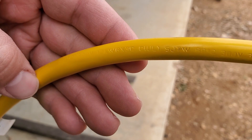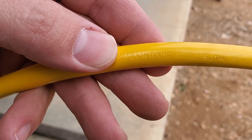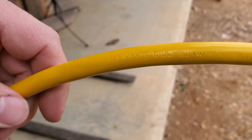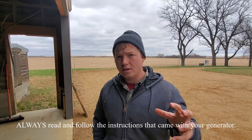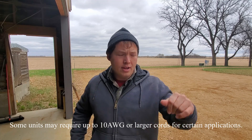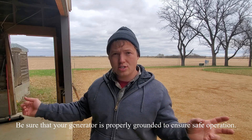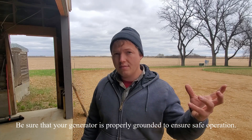If you look closely at the printing on the side of your cord, you'll be able to see — this one right here is a 12 gauge cord, so we are good to go. This can handle a full 20 amps of power. But you want to stay away from lighter gauge cords because if you overload a 14 gauge or a 16 gauge extension cord, you run the risk of that cord eventually heating up and possibly catching on fire. They make some really cool generator cords that are designed specifically for this application, with a really beefy extension cord and more receptacles on the end so that you can distribute that power in your house safely.